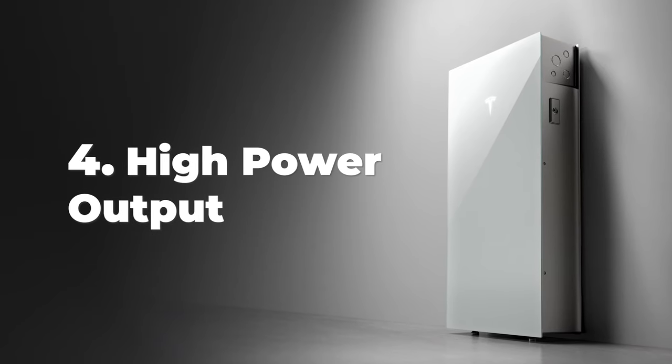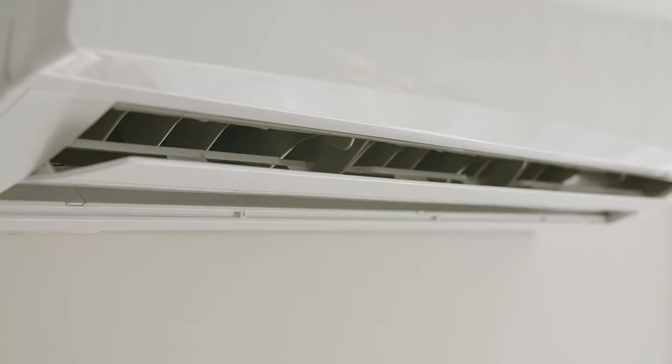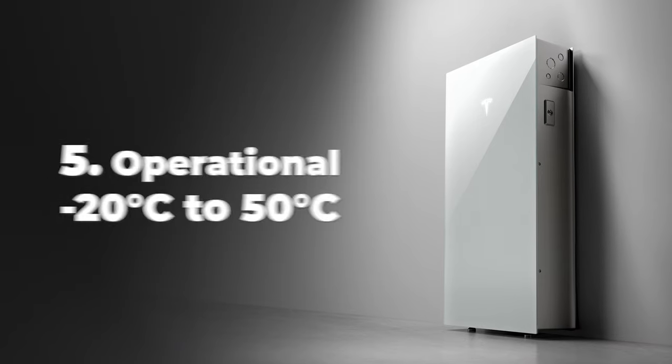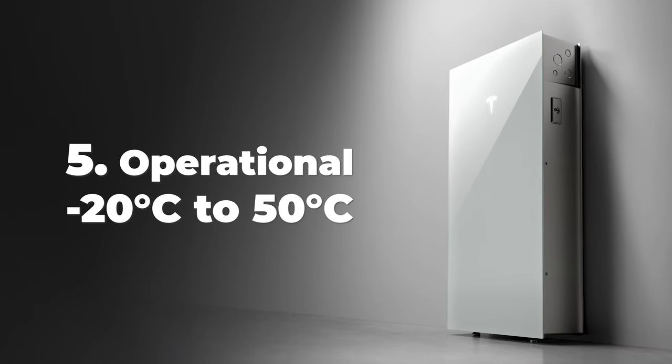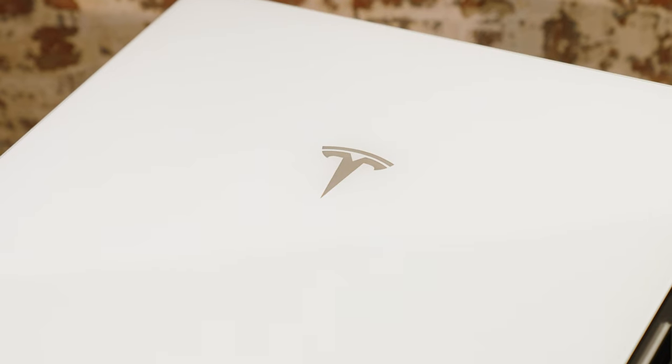It's actually fully flood-proof — there is a battery sitting there in water. You can discharge around 10–11 kilowatt hours out of the battery, so should you have a blackout with your aircon on, your system will not blink because you get whole-of-house backup. The battery can be used at minus 20 degrees or 50 degrees, opening up installation areas that weren't available before.